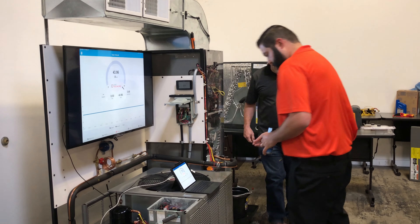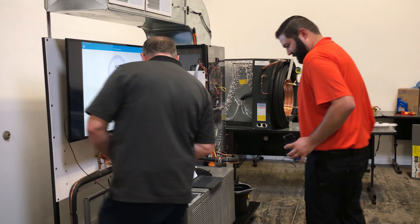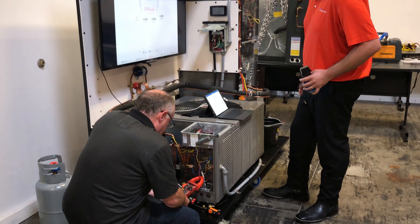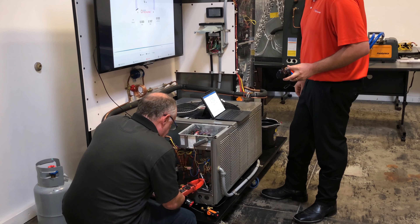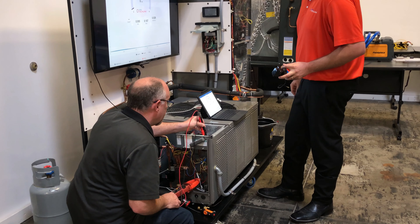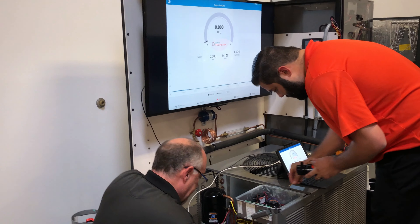Alright, so your power is off. Let's just check that real quick and make sure we're not going to barbecue you — just because I like you, your dad would probably be upset if I didn't do this for you. So we'll just double check that real quick. This is what makes a relationship good — we watch out for each other. Alright, so we are good here. We have no voltage on there. Go ahead and we can put that on there and I'll get set up again for another test.